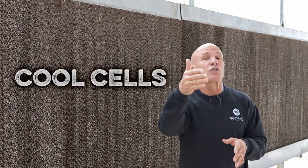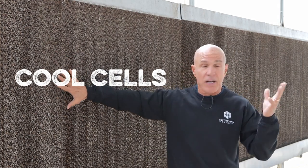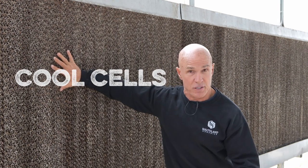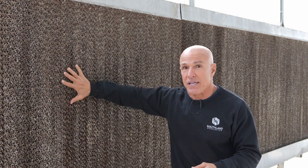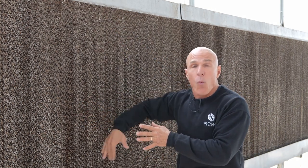And then last, those cool cells. The fans are responsible for bringing the air, and those cool cells — we're kind of in our greenhouse here at the farm — but this is responsible for cooling it. We can't put air conditioners in the chicken house, so this is your air conditioner. You've got to take care of these things, because as much as the fan is responsible for the flow of the air, these are responsible for the flow of the water.